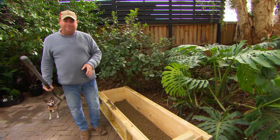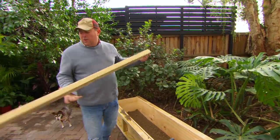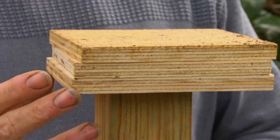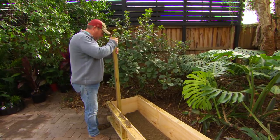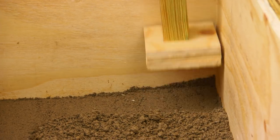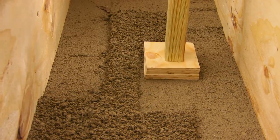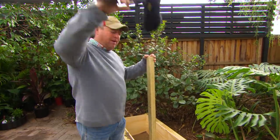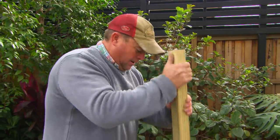From here on the process is the known rammed earth — we've got earth and we need to ram it. I should copyright this tool: it's made of offcuts of ply and timber, but because it's got a square pad on the bottom I put three of them together to get a bit of oomph. The best thing compared to a sledgehammer is that it's square, so you can get right up to the edge and do all the corners. I'm going for a layered effect, a bit like lasagna from the side. About four or five good whacks in one spot and you're right — you can actually hear it. It sounds like it's pushing the air out, and then all of a sudden it sounds more like a smack, like you're hitting a solid wall.